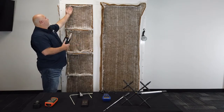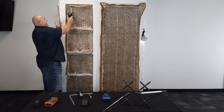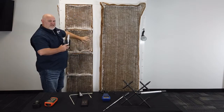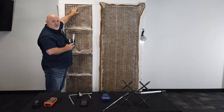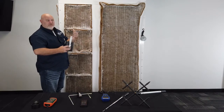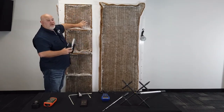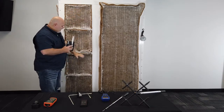What we'd like to do is be about two to three inches from the filter face and take that reading there, recording it. It might be 300, it might be 350. If the fan is mounted on top and you're not using any type of baffling system in the exhaust plenum, it's likely that with a clean filter you're going to have more airflow closer to the fan than lower down. As the booth functions and overspray gets into the filters, resistance goes up in that filter, which moves the air down the plenum because it takes the path of least resistance.